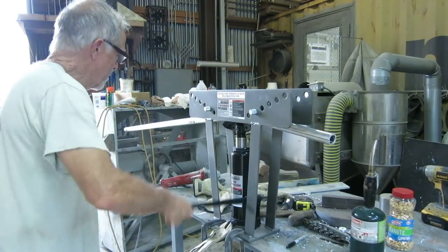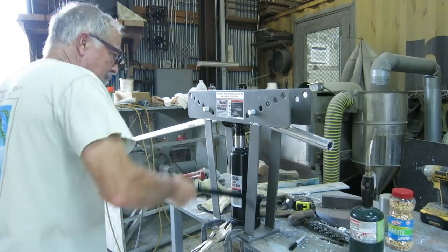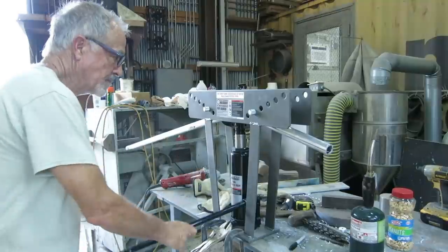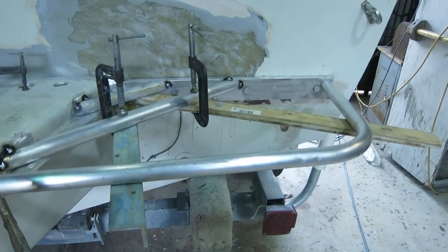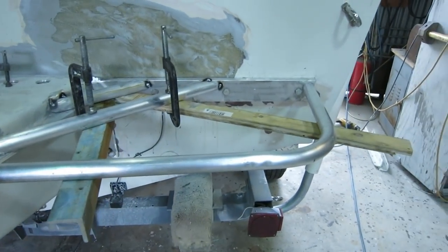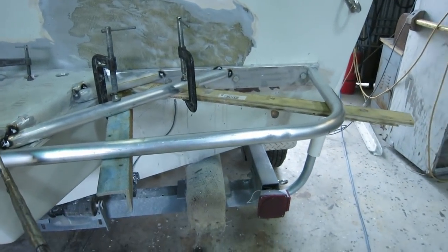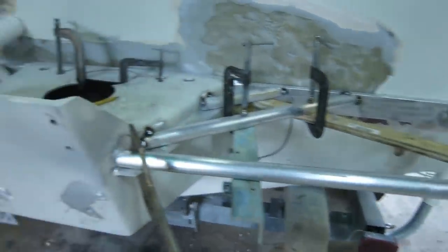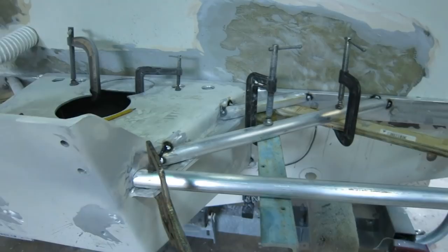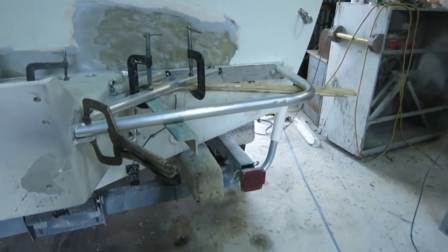I started fitting the curve around the outside — this is just aesthetics. Made a few bends, looked at it, made a couple more bends, got one side I liked, then tried to match it as close as possible for the other side. Third pipe fitted — this is the outside edge of the swim step with a mirror image on the other side. We're going to tack it in place. This one is not very strong — I'm going to have to put something under it to hold people's weight. These two short ones are very strong but this one is just for the shape — it would probably bend if someone jumped on it.